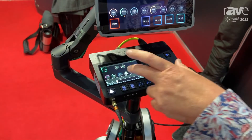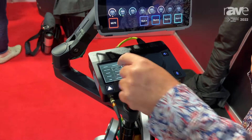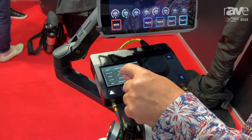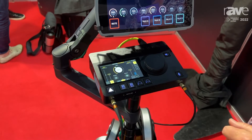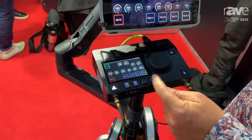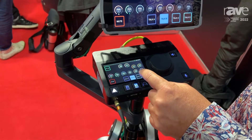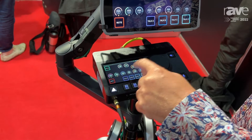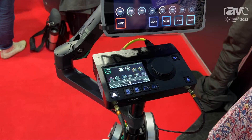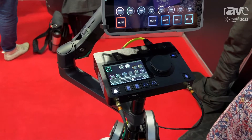It could also be a physical analog input if you want. And then you have your two microphone inputs. You have an EQ for input one, and you have a dynamics section as well so that you can put a compressor in there — you can change your ratio and everything you need. And then you have different destinations to be able to talk to. We call them Talk A, B, C, D, but it could be Studio One or Paul and Gene or whatever. On the top you have intercom — two intercom inputs — and you have a sidetone so that it's your own level in the headphone.